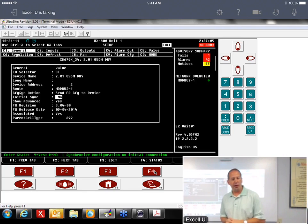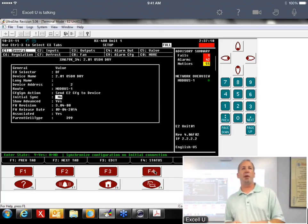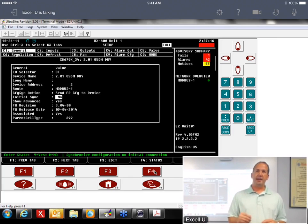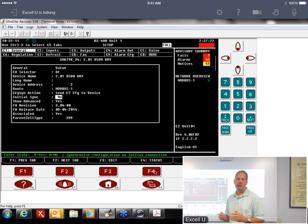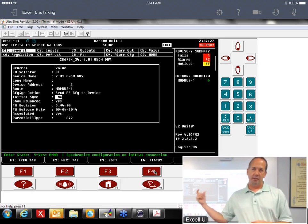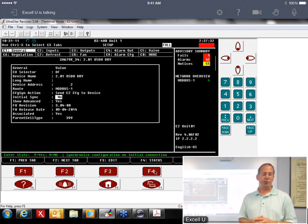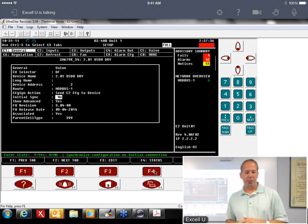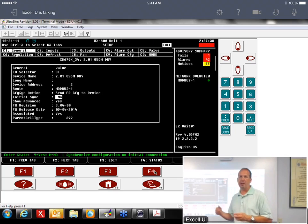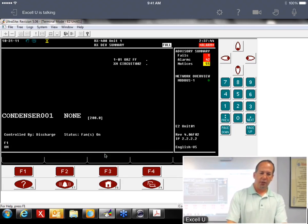So the next thing you do is go plug your network back in. Don't forget that. Then you would go through the commissioning process that we just went through, which is the network summary, highlight the device, commission it, assign the address. It should already be there, but I would just recommission it to make sure. And then it should pop up online. Send those parameters down to the new device, because again, you have a new device with the bad parameters in it. So you'd want to go to the config sync action, or not, I'm sorry, not that. You'd want to go to the action menu.